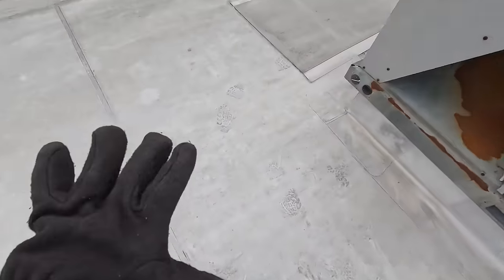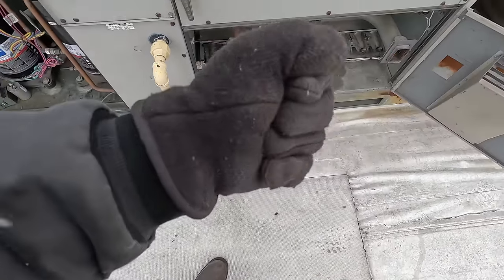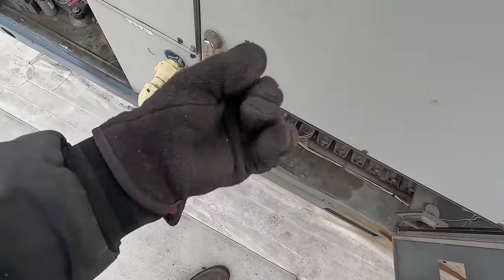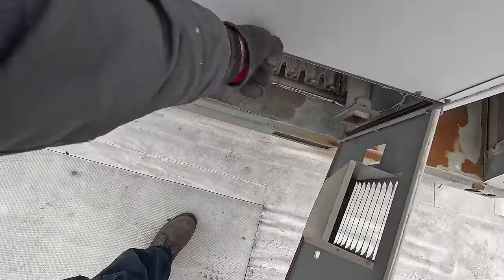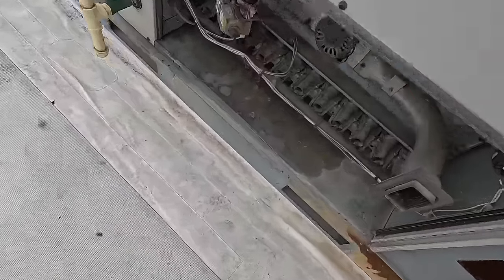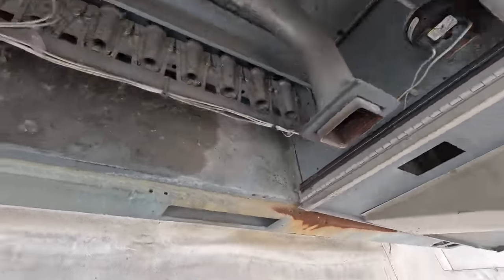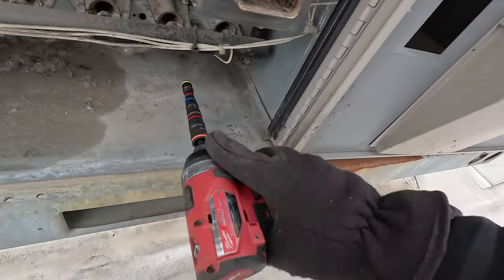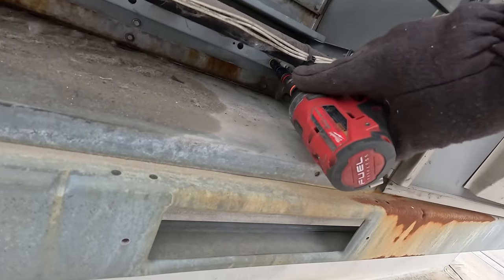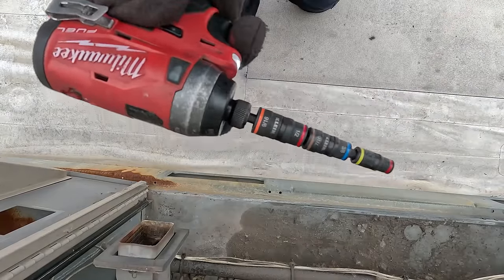Got the panel back on. These gloves are the heavy duty ones — this is the first winter of 2023 going into 24. These work really good and surprisingly, as floppy as they are, you can literally work in them. Let's go ahead and clean this flame sensor. That has always been an issue with Lennox from day one, going all the way back to mid-90s. I got this new one here — this one doesn't have the 11/16th, it has the 9/16th instead.